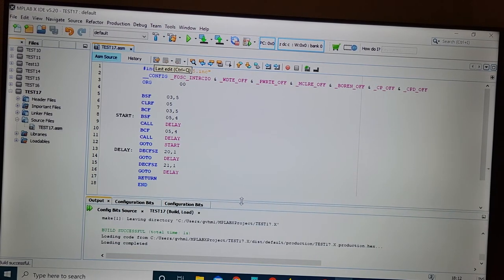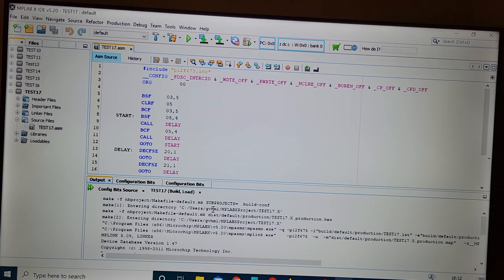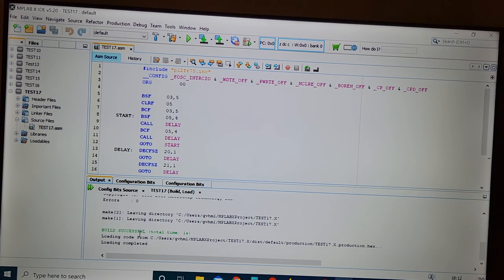Over here in the split window, there's a little bit of information coming back from the compiler — it worked. The little green thing says it's a build success. So now I've compiled it. I want to shove it into that chip — download it into that chip. I use this little button here, and it's going to take it and put it down my USB cable into the PicKit 3 and into my little chip. I'm going to push this button and I'll have that program stuck in my little chip.